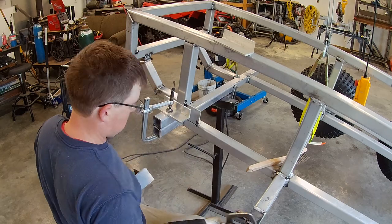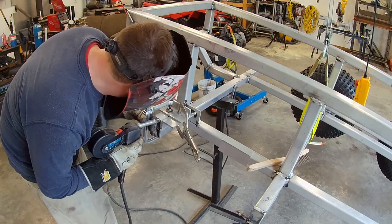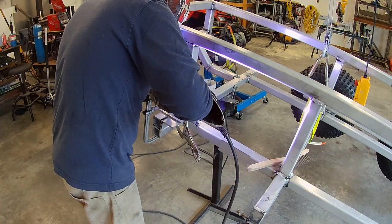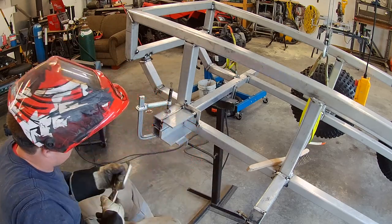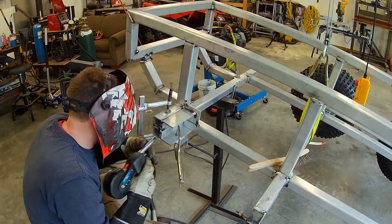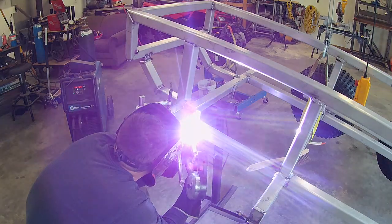It's always best to put a component together with its pieces, tacking it first. If you go and put a part in and weld that joint and then move on to the next, things will start warping and twisting. It's always better to use the part to help fixture itself, and it'll just make the outcome stay square and to the measurements you want.